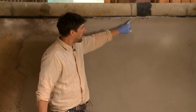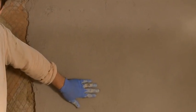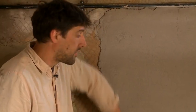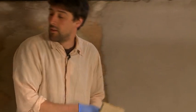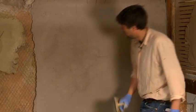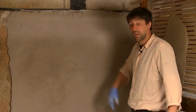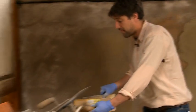This was laid on 24 hours ago. You can see some shrinkage cracks on the top. At the end of yesterday I went over it to open up the surface. I want to get air into the plaster so it can carbonate — to turn back into calcium carbonate. I went over it with a black sponge float, sprayed the wall down, and worked it back to open up the surface. Today, this could be an acceptable finish for external render or a rustic cottage look, but for a really flat smooth wall I'd float it again.